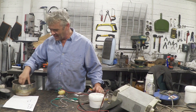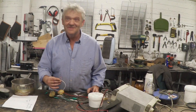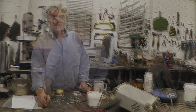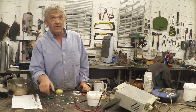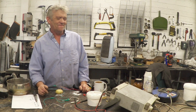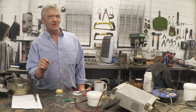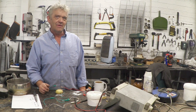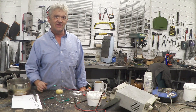Here are my boiled potatoes that I've let cool down. Let's swap it over and see what happens. It is definitely much brighter. Let's take some readings. With the raw potato connected in series, we're drawing 0.5 of a microamp. These LEDs will light with incredibly low amperage — 0.5 of a microamp is enough to just barely light that LED in the raw potato.